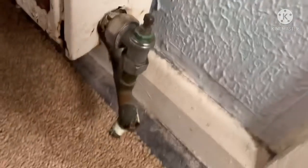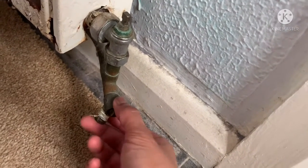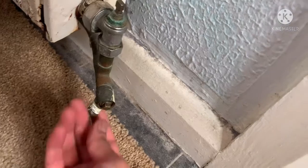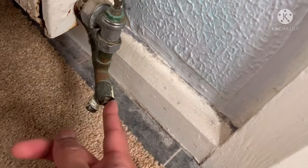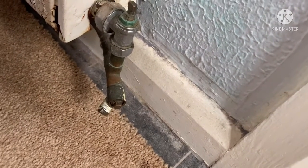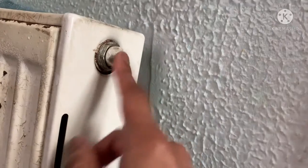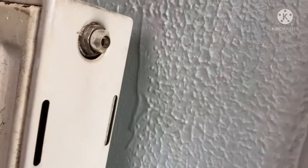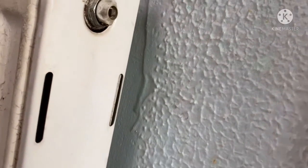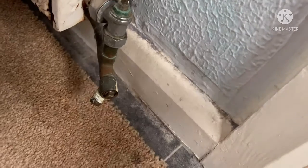So just to recap — the question was how can you drain your system. This drain point is what you're looking for, and it's usually at one of the lowest points of your heating system on your property. Attach the hose pipe, turn it anti-clockwise using pliers to let the water out, then use a radiator bleed key to loosen all the radiator bleed valves slightly across the property. Once the water's drained, close all of these off, remove your pipe, and your system is drained.